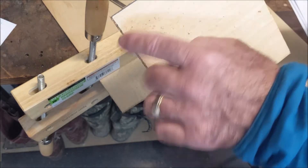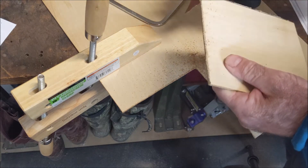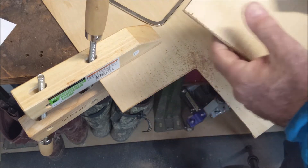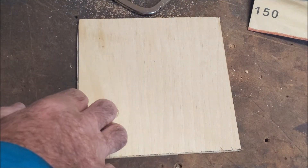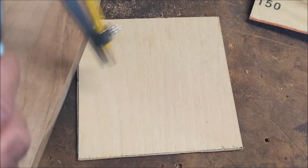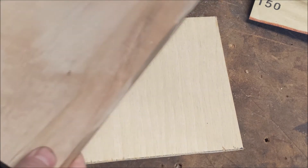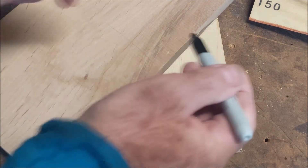There's my six-by-six square. You can see my second cut was a lot straighter at a better angle with my coping saw — pretty flat like that, so I could see where I was going, and I used the whole blade. Either way is going to work out. Now there are a couple ways to do the layout on here. We're actually going to do it with constructions, using only a straight edge and a compass and a pencil. The first one I'm going to do — I'm going to use a Sharpie so it's easier to see — is go corner to corner.